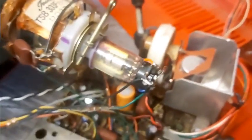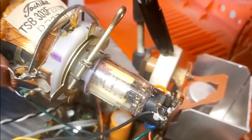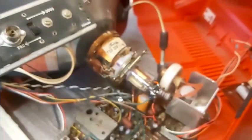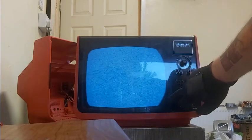As you can see, this is a fairly similar layout, although it's quite an older, more old-fashioned sort of layout for the line output transformer. When these have been used for hundreds — probably thousands — of hours, this rubber tire has a tendency to melt. But as you can see it's pretty intact here, and the cathode there is nice and shiny. If it were discolored, a dull purple color, then this TV probably would have had quite a few hours on it.